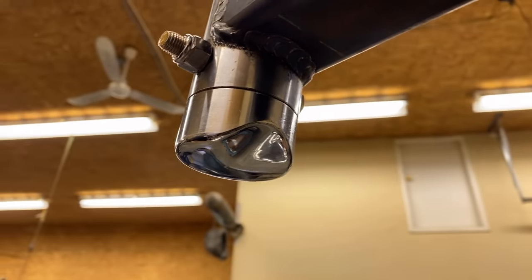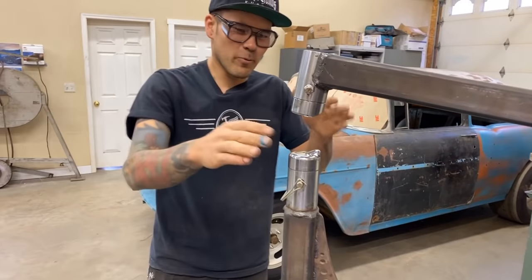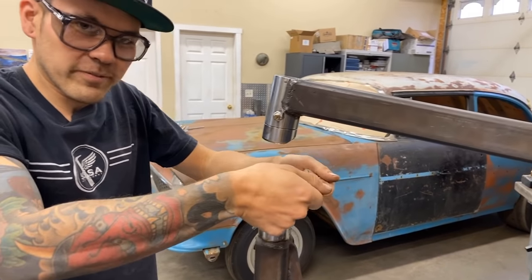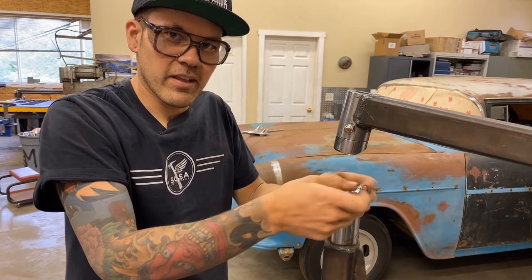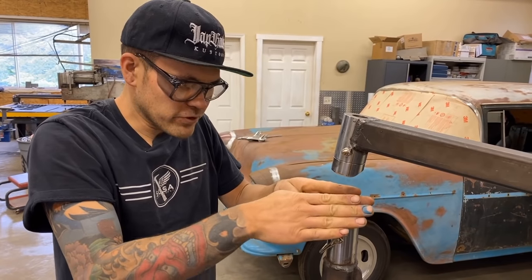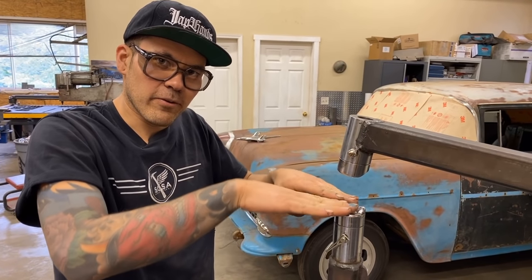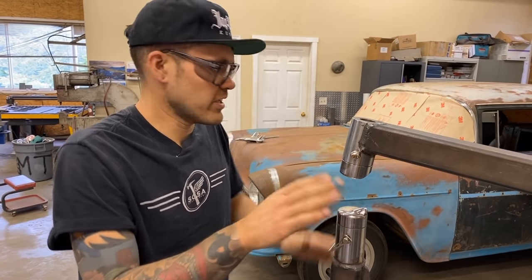The top die, that female die, is basically just a notch cut in it for this lower die. So what it does is it creates a wrinkle when you push your sheet metal in. It smashes a wrinkle into it. And then as you pull your sheet metal out, it pushes the wrinkle back together, which shrinks the material. It's the best explanation I can give you of that.